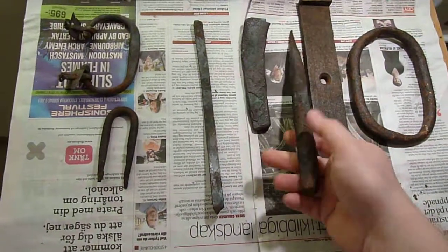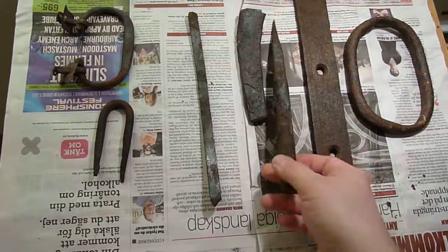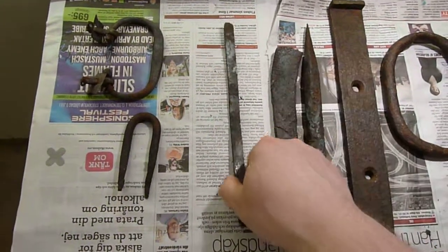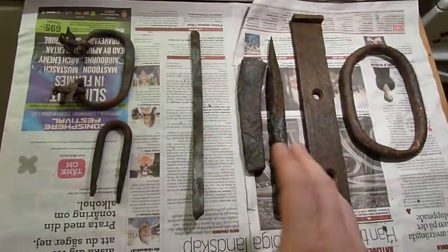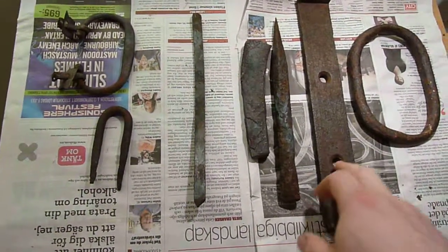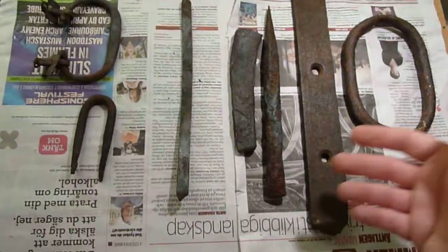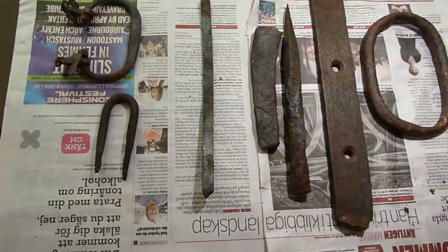This is probably part of construction steel and could also be the wrong type of iron. As you can see, this has flakes as well, so this is probably also some type of wrought iron. This maybe might be steel or fine wrought iron. But at least I have something here. The idea is that if this is the right type of material - if this is charcoal iron - I can make some mail rings in the proper material for medieval or Viking age, to get it ultra authentic.